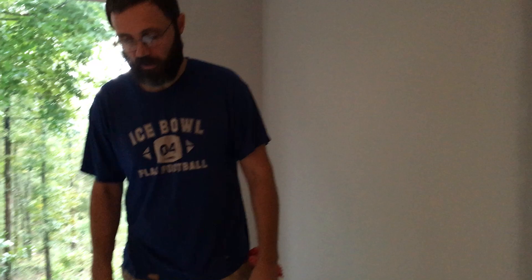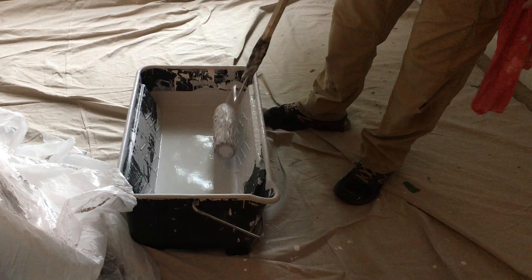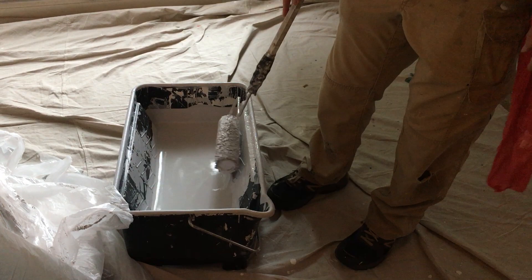So if you take those two or three buckets — however many you have on that project — mix them all together in a big bucket or five-gallon container like this one down here. People tend to buy those small ones from the store, but you step in them, they get everywhere, they spill. I like this really big deep bucket. Whether I'm working with two or three gallons or four or five, it's a good deep bucket that's less likely to spill. I know where it's at. Mixing them all together will really help prevent that hat band discoloration effect.